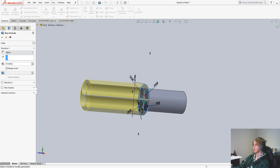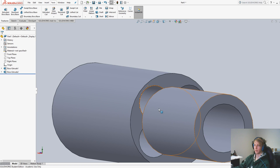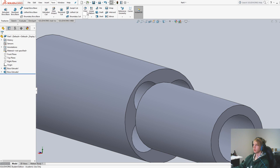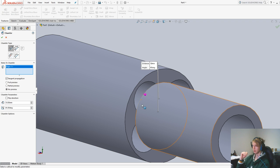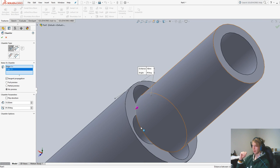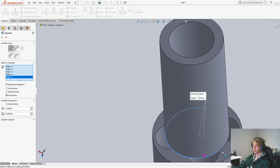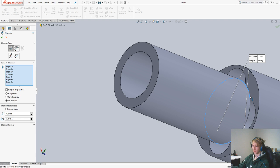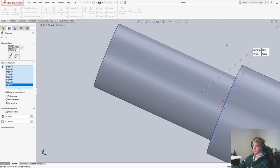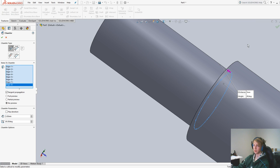Yep. And as you can see, it doesn't really look too nice at the back here, and also there are air leak holes right there. What I would do to fix that is put a chamfer on the edge here, around the base of this entire piece, which unfortunately I have to do in individual little segments, because it sees them as different pieces. And I can tell you now that that's not 10 millimeters. So, let's go 5 millimeters.